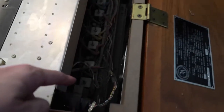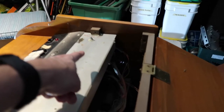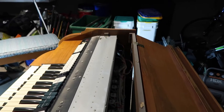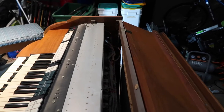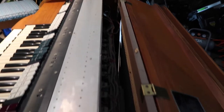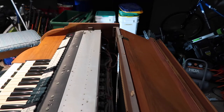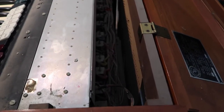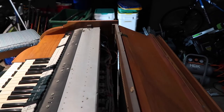I've counted up a total of 12 of them. There's also this potentiometer over here on the side for something. So I'm not sure what the time base is that this uses. The Hammond organ uses basically the 60 cycle as its time base reference. And the Lowry uses probably a crystal. That's from the 70s and uses some integrated circuits, so I'm guessing it's based on a crystal